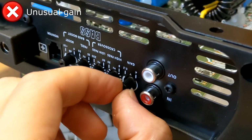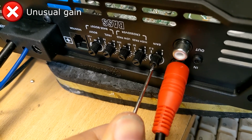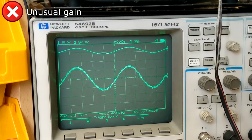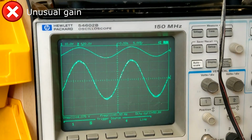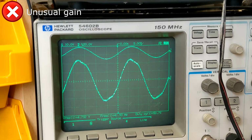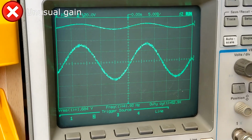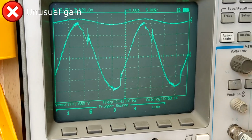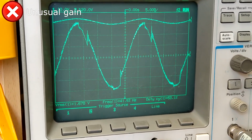The gain knob is very sensitive and jerky feeling. At its minimum position, it appears to be running a specifically set 4V input mode that should bring the amp to a clip point pretty much as the 4V mark is reached on the signal. As soon as you turn the knob away from minimum position though, it seems to switch instantly to a different mode, jumping up considerably at first and then following a linear curve upwards. It's worth bearing that in mind.